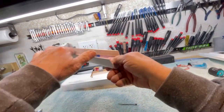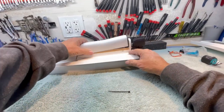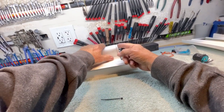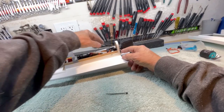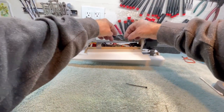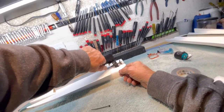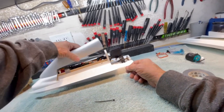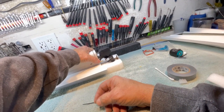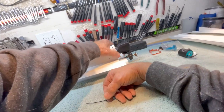I did hog out my cowl here because I was having trouble getting everything to fit in there. Big B was getting water in his and he did his cowl a little bit differently — he has his cowl going the entire way back, but his is cut off here. I thought for ease of taping up and continuity of the tape joint, I wanted a solid back there, and that way it gives you a place to tape up right along there. I think that's where Big B is getting his water — right in there because it's slashing and splashing around back there.